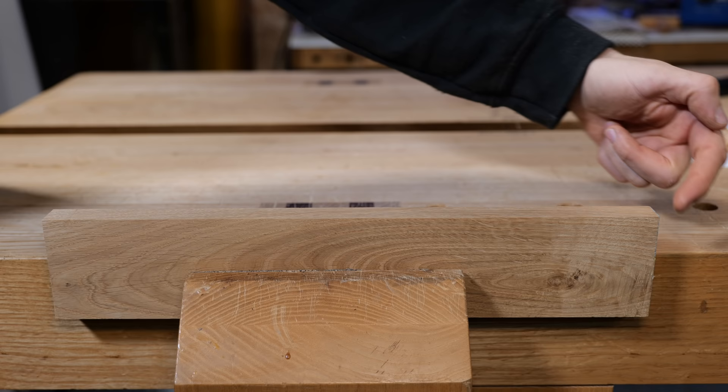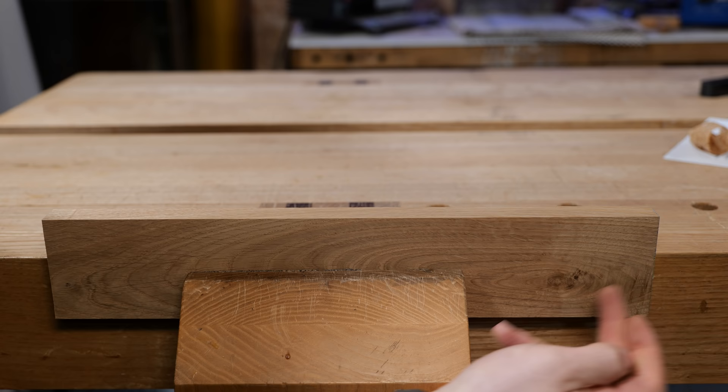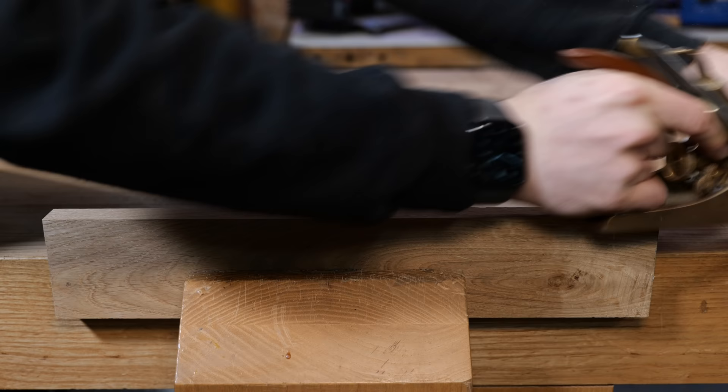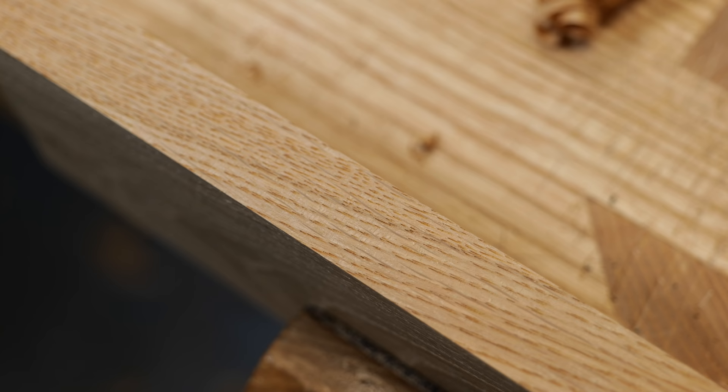You can really see that tear out from entering the cut now. On this one the grain is travelling up to the top right, which is in reverse, and there's a bit going up towards the top left — I suspect I'll get a little tear out there. First, let's plane in the direction of the grain — working beautifully. And then let's plane against the grain. Not too bad, but it is catching at the end. Although it's not as bad as the face, we definitely still got some tear out on the edge from planing against the grain.